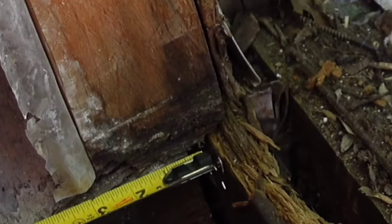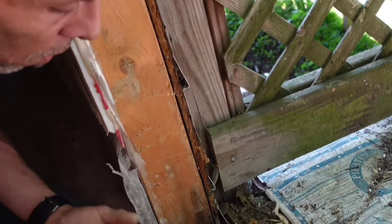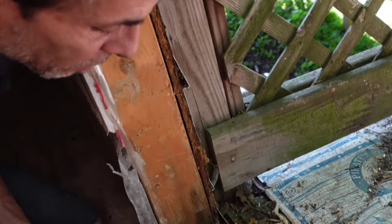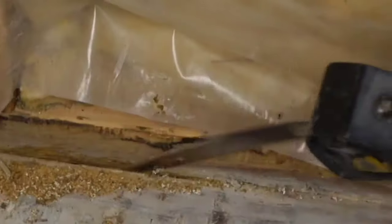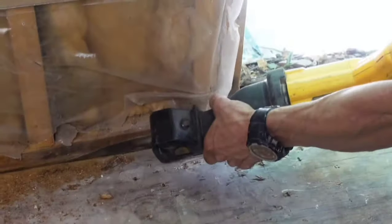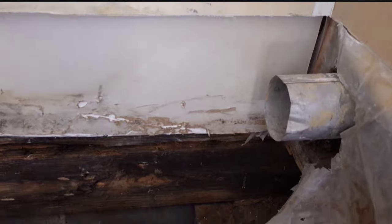As you can see from the plywood, it was really hard to get a measurement off the back of the house and pull four foot. In that video I went over where you'd want to pull your measurements from. Once we got our line snapped and were ready to go, I got a Sawzall and cut all the plywood out from that area and around the doorway so I could get it replaced. I exposed all the floor joists and explained what was going to happen once we got all the plywood torn up and needed to do some blocking to support our new subfloor.